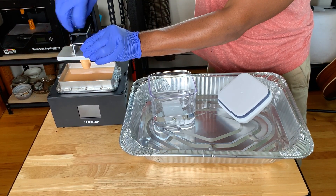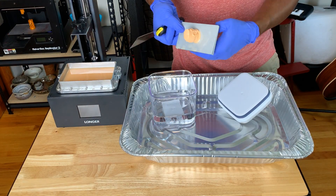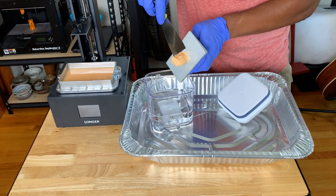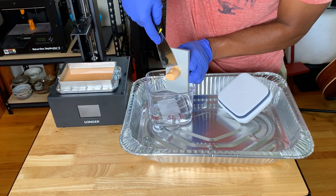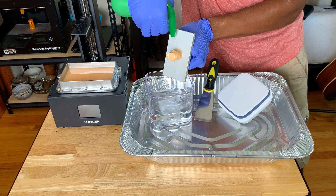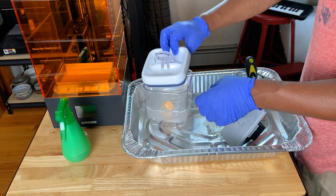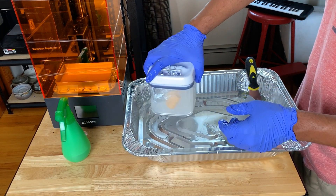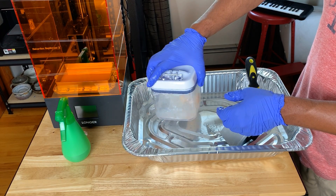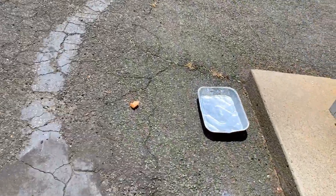The guide called for washing the prints in 95% alcohol, but we're still in the middle of the COVID-19 pandemic and finding alcohol is really hard. I was lucky enough to score a 70% bottle, so that's what I'm going with. I had a bit of a tough time scraping the model off the build plate — I'm thinking I might need to use a slightly thicker sheet of paper next time I level the bed, to give it a little more of a gap. I eventually got it off, into the alcohol, swished it around a bit, and let it sit for a few minutes to wash away all the extra resin. I don't have a UV curing station, but it's a nice sunny day so I'm going to place this outside for a few minutes.